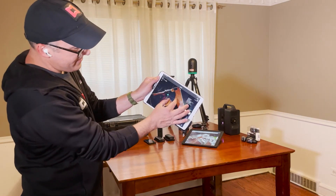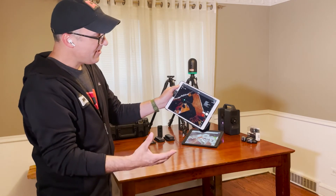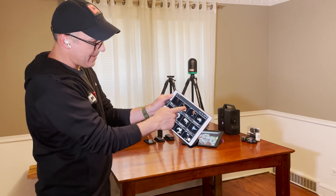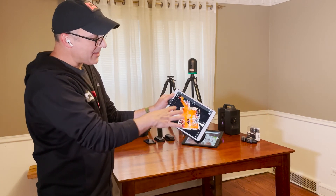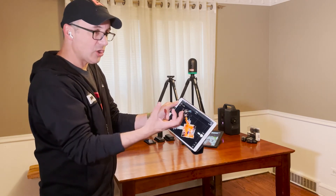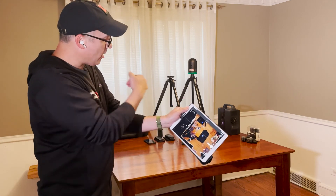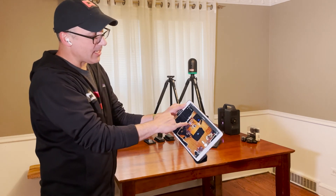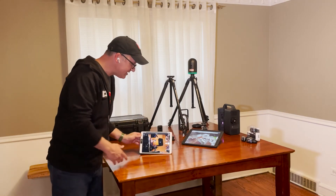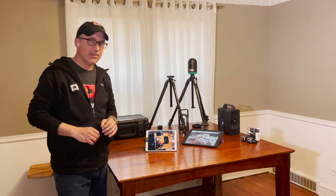Looking at the image — for an untrained user you may not see much, but these darker areas are occlusions: data missed. There's no information from on top of the table or beside it — it's too close. Going back to previous episodes, that same tabletop was captured much better — gathering information much closer in proximity than the BLK360. Going back to the Pro 2, it's a similar output to the 360 cameras: I can see the tabletop and make out the items on there. The Pro 2 and 360 cameras gather more data closer in proximity indoors, while the BLK360 is great outdoors in big spaces.